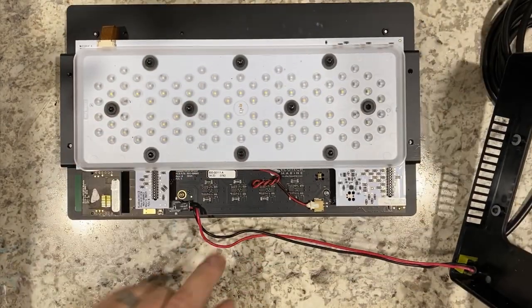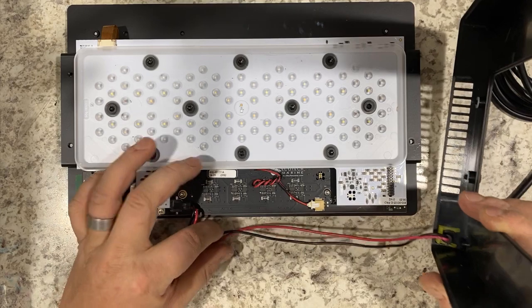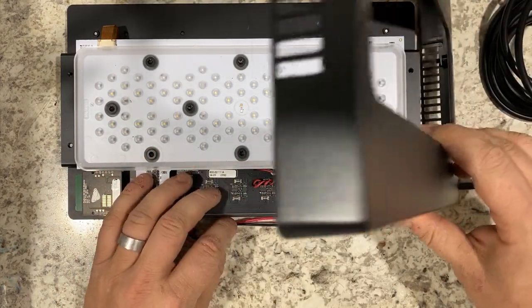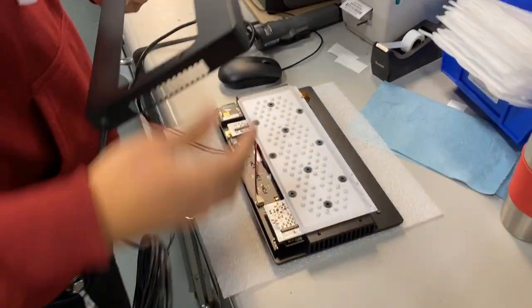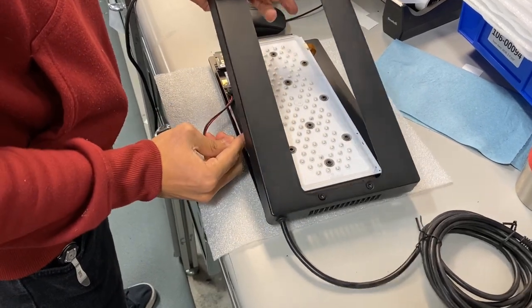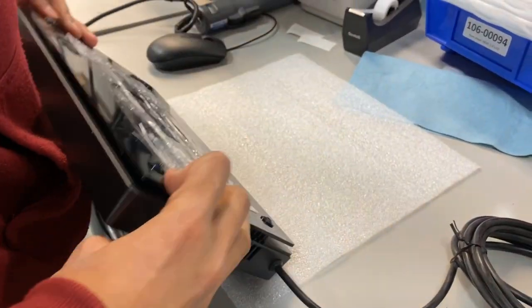On the XR30, all the previous steps are almost identical, but the location of the power connector is a little bit different, as is the wire routing. When you go to reassemble the XR30, run the wires under the corner of the cluster board, then pull the wires so that they're a little tight, put the cover mostly into place, and then push those wires under the driver board. A professional on the line actually puts a little twist in the wires so they are shorter when pushing them under — it makes it even easier.